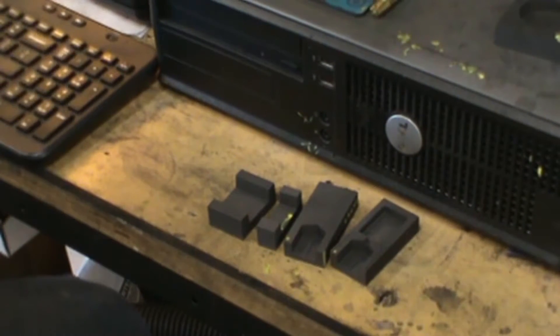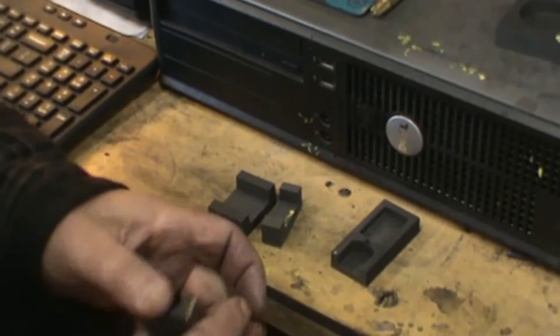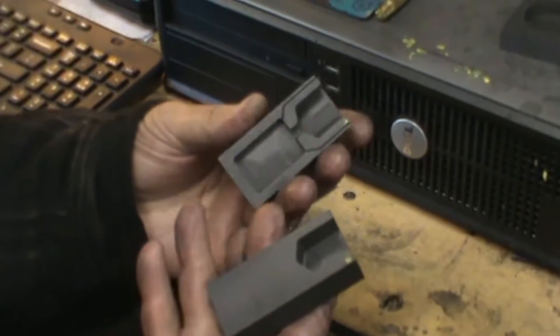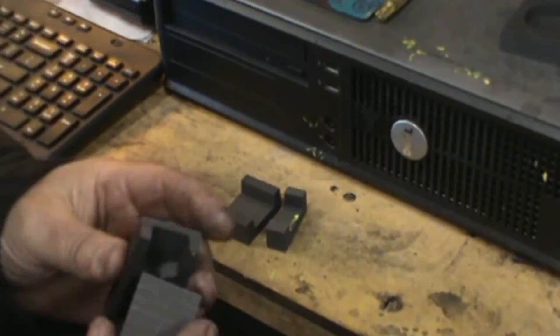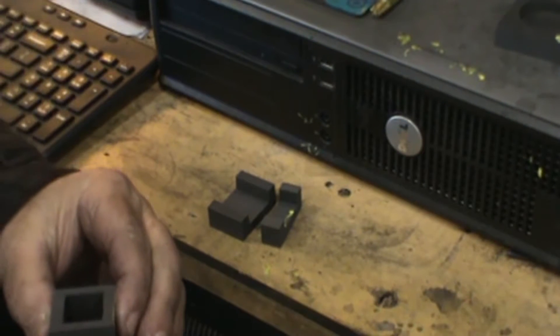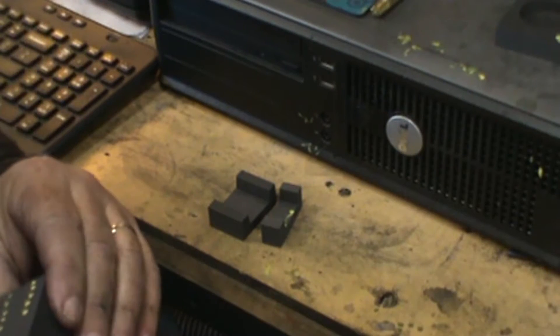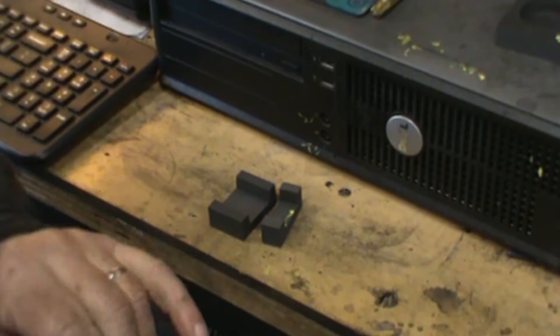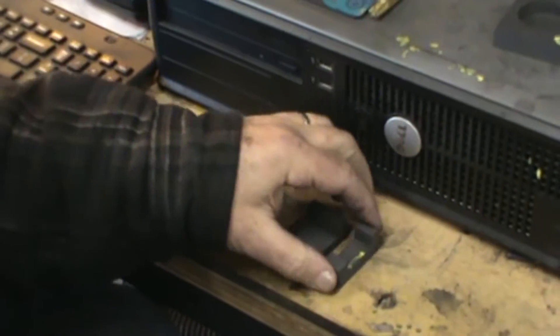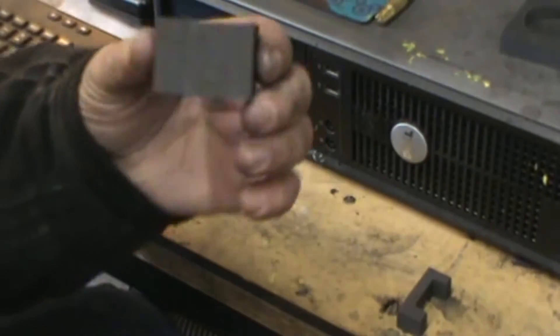That's going to be just a quick video on instructions on how to use the new graphite clamps. They're for my gravity molds. The metal clamps were okay, but they tend to loosen up because steel expands more than graphite. So I came up with the idea to use graphite clamps, and this design right here — this is the top piece and this is the base.